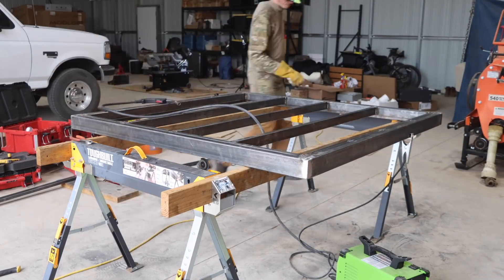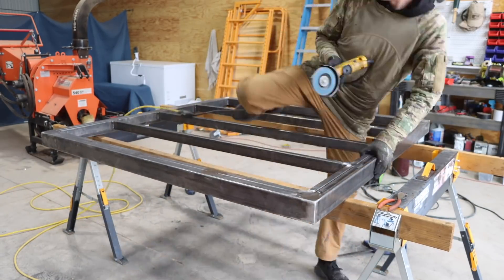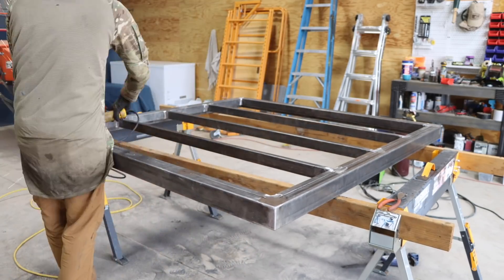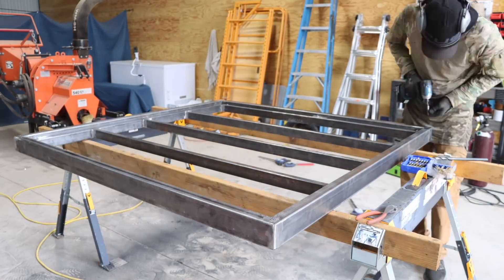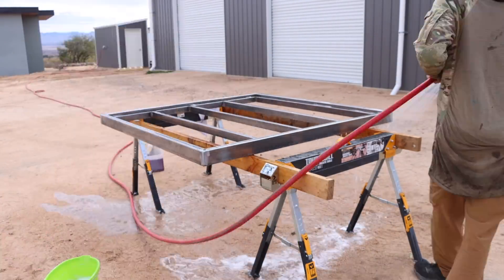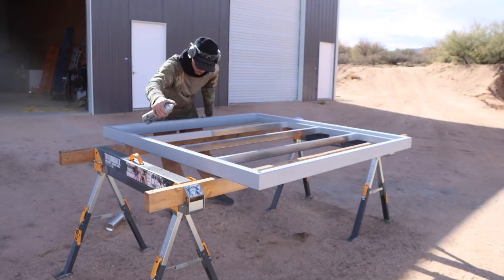One of the beautiful things about metal fabrication when you're not a great welder yet is that if you've got some goopy and globby welds, you can grind them down and make them look really good. Obviously one of the most important things when welding is ensuring heat penetration and getting a fundamentally good weld — that's more important than it looking pretty. But we want to go for both pretty and strong. One thing I learned from Orion is prep work — ensuring the steel is cleaned and degreased of any oil so that when you prime and paint it, everything adheres much better.